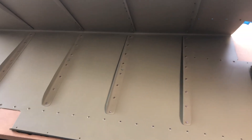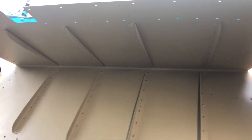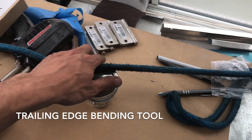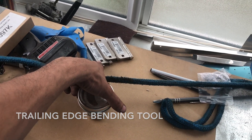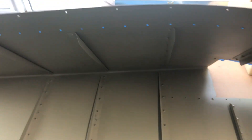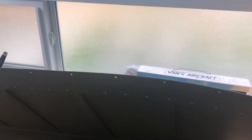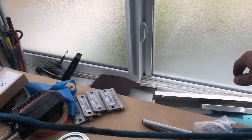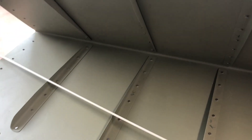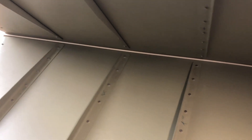But that went very well. We are now ready to final bend the trailing edge seam. I'm still going to be making my jig. I've got my hinges here and I'll be making a trailing edge jig as noted in the plans with like a 2x6 or something to that effect. I also have a 1/8" dowel that's kind of exact here. I plan on having that tucked in the root to make sure that we have a nice even bend.